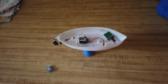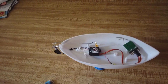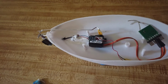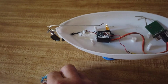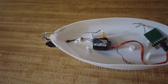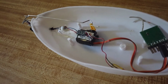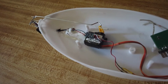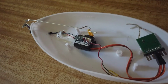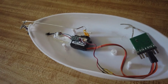Well, there's a lesson learned, to not use anything other than the motor that comes with the servo. I managed to blow up the other circuit. It's a nice smell and whiff of smoke when I tried to power up and test. So I've ended up taking apart one of this type, which is a very tiny thing, left its motor connected, redone everything, and it seems to run fine. But also interestingly though, that motor does seem to spin the prop pretty well. Oh, anyway, so like I say, lesson learned. Don't be putting bigger motors or different motors on to a servo.